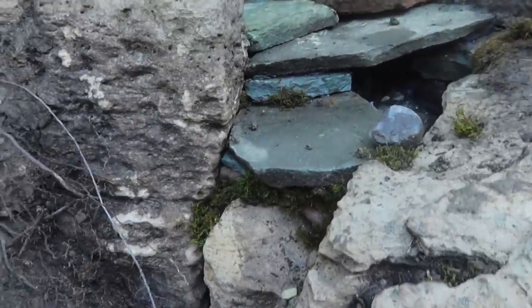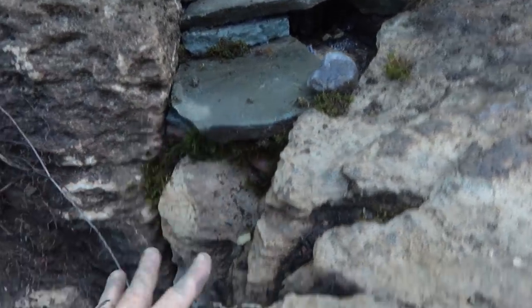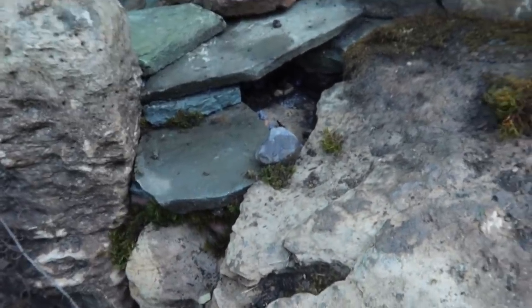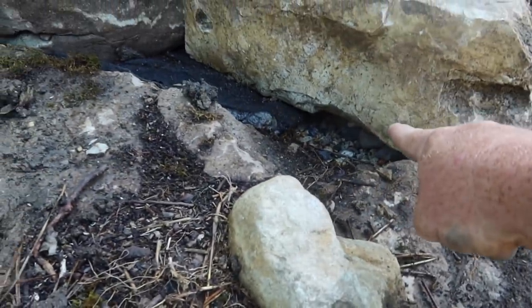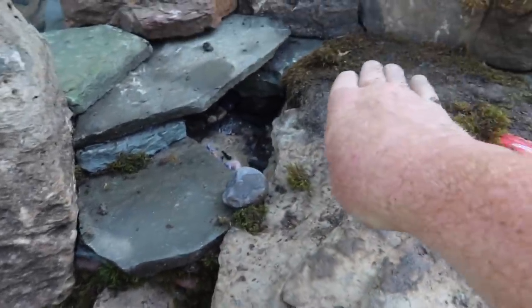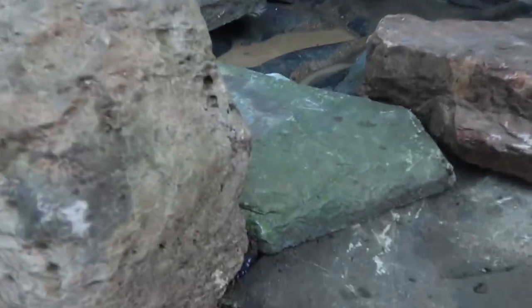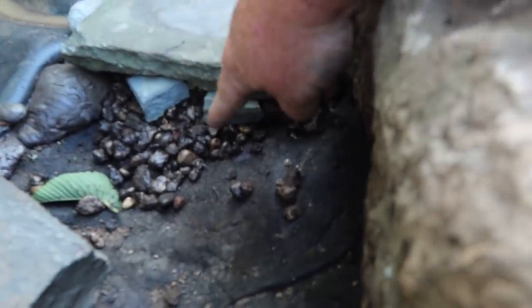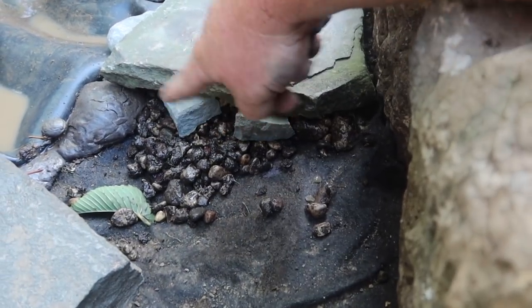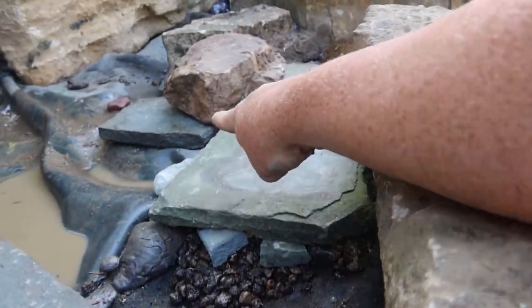If I can get a little bit of water up onto this rock it would be even better as it just kind of drips down the face. I'm in here just slowly stacking some slate and I created a little pool right in here so when it comes off of this it can drop a little better rather than shoot off. The other reason I did that is I want to keep the water level here lower than the liner back over in here. Keeping this down at this level rather than building all this up avoids big problems with water going back over in there even though I have a weep hole. I've got some other slate to play around with, and I'll foam all of this and seal it up really well, making sure that water pools up and comes up and over.